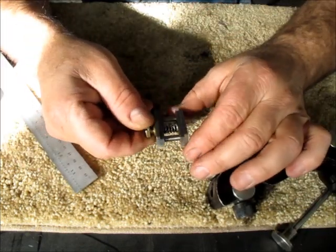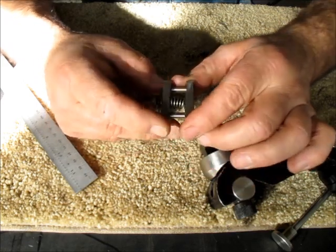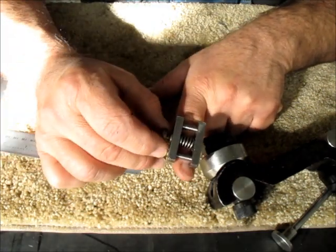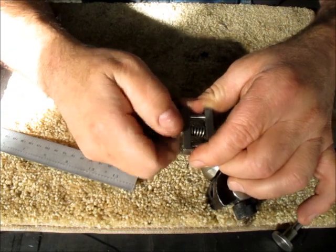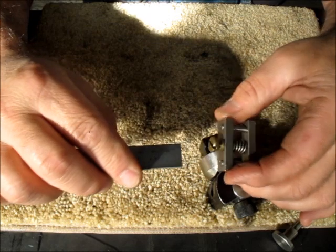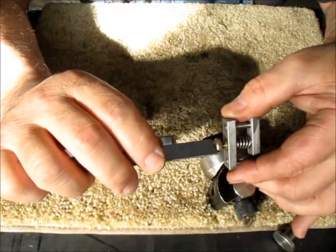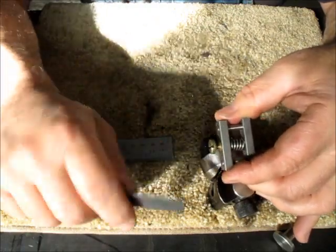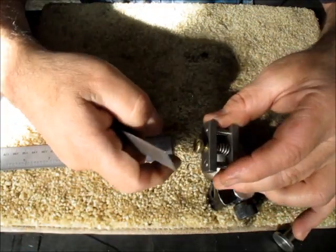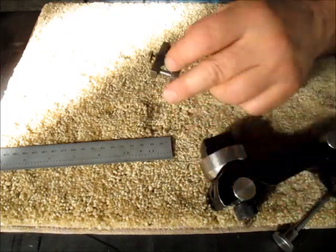The other stop I use is one I made a long time ago when I was just a kid — a little shop project. This one clamps on the top jaw of the Kurt vise and it's got a little knurled knob so I can just run it up with my hand. I milled a little slot in there that fits a scale, so when I have my 150mm scale I can just stick it in and tighten it up without needing to grab a tool.